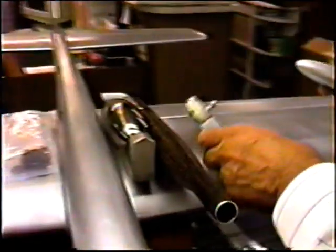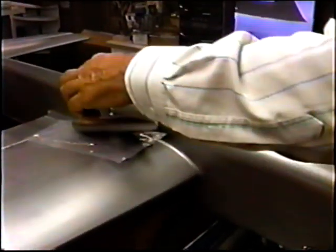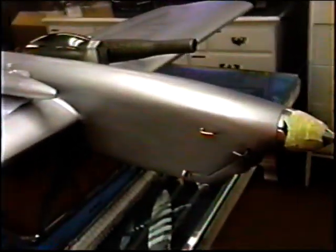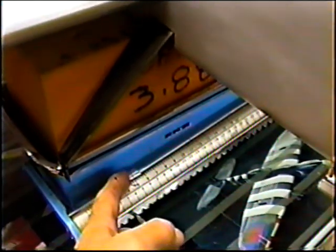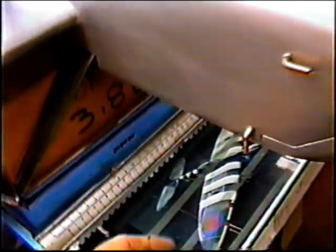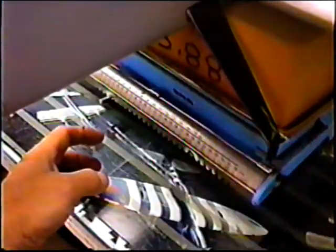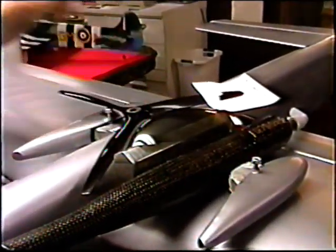Now I'm putting all the hardware that's going to go on here, put it on real carefully. Okay, that's the hinges, the canopy. You need a prop too. Where's George's prop? You can put George's prop up here. Anyway, what we want to do is get a weight of where we are right now. I don't have a prop. All right. Figure 1 ounce for the prop. A prop is usually about 1 ounce, 1.5 ounces if it's a 2-blade. What about these props that you have here? Yeah, just put Dennis's prop up there for now. Doesn't matter which one. You don't know what prop you're going to use. Add pitch. Yeah, lay that up there. That's the prop you're probably going to start with. That one I didn't re-pitch yet.